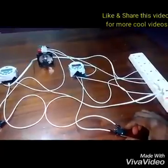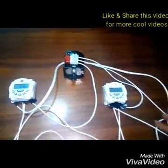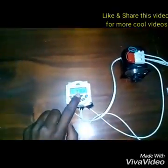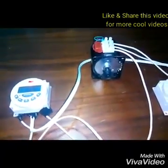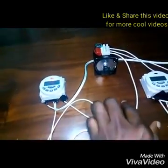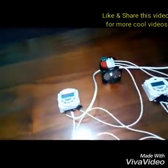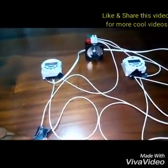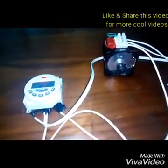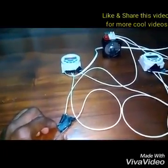If the switch is released, the rotation continues. If the tray hits it again, it is going to stop the rotation. Let's test for the anti-clockwise rotation. You can see the motor turning in the other direction. If you have your chain around it fitted to the egg trays, the egg tray moves this way. When the tray hits the limit switch, the egg motor stops, and when the switch is released, the rotation continues.